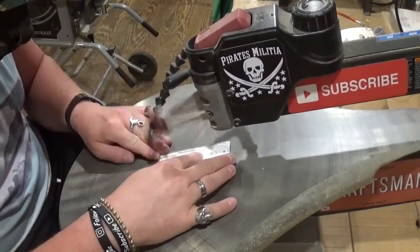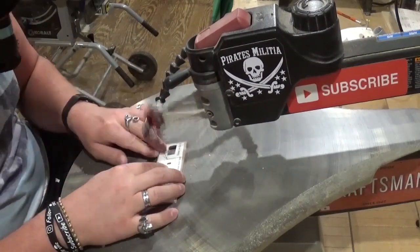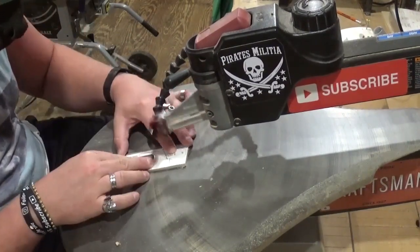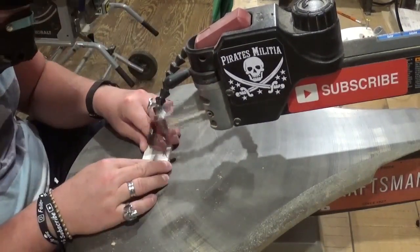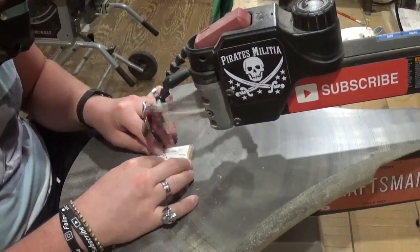I'm using the same blade to cut out all the thicknesses of material on this project. Now that all of the internal cutting is done — one hole is just to simulate the hole in the scroll saw table — we will proceed to cut out everything else, which will be all outside cuts that release everything from the waste wood.